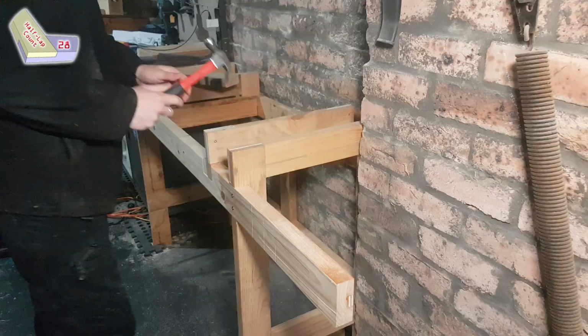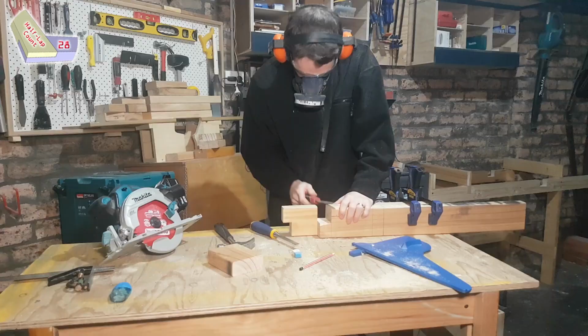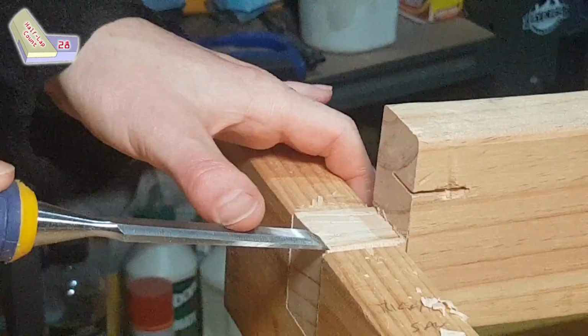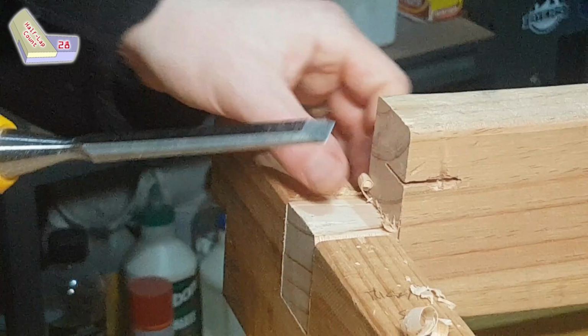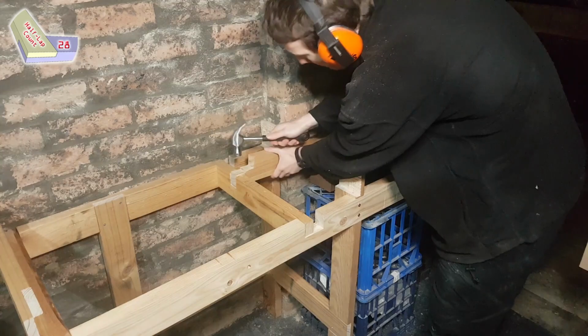So I had kept some of the frame unattached in order to allow me to fit in this back piece. It was going to have three connections, which I've cut off camera here. And importantly, that little notch you can see on the side will actually have the mitre saw sitting on top of it on its MDF base, right here. So the mitre saw's weight will be bearing down, all 32 kilos of it, including the MDF on that, onto that little peg, and should stop that draw from being able to lift up regardless of how much weight I put on there. This was a bit of a tricky fitting together exercise, but it did bump us over the magic 30 number of half laps cut.